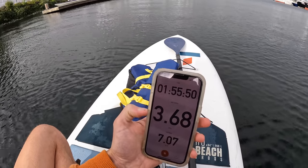This battery has 640 watt hours, so I only used 60% of its capacity. That means I could have gone 18.7 kilometers or 11.6 miles if I hadn't gotten too cold. The Power Queen 25.6V 100 amp-hour battery I used for my boat has 2,560 watt hours — if I strapped that onto the paddleboard, I could go 75 kilometers or 46 miles, assuming the same speed, which would take 9.5 hours. Using MavExplorer to analyze the ArduPilot log data, I could check efficiency at different speeds: it's very efficient at low speeds and gets much worse as we go faster. At 0.8 meters per second with the 2,560 watt-hour battery, I could go 427 kilometers or 265 miles — a journey that would take 6 days non-stop.